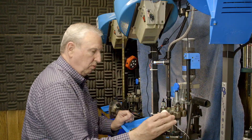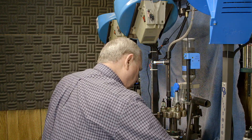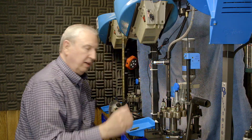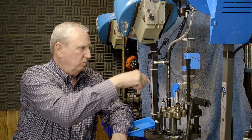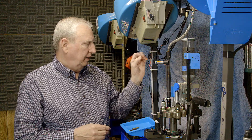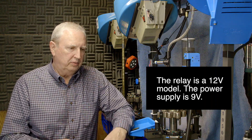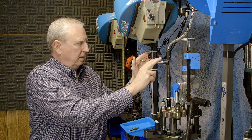You'll need one of these — a little power wall wart. Originally I said you had to have 12 volts, but you don't. This sensor will work on anything from about 5 to 35 volts. The relay I've got on there now is rated for 12, but I'm currently running it at 9 volts. I know it works with 9 volts, I know it works with 12, and it would probably work with 15 equally well. That's just the circuit between the sensor and the relay — the MR Bullet Feeder has its own power supply and we don't affect that at all.